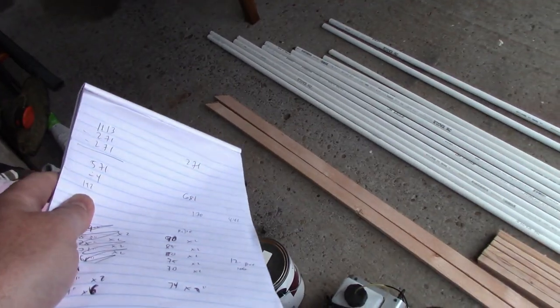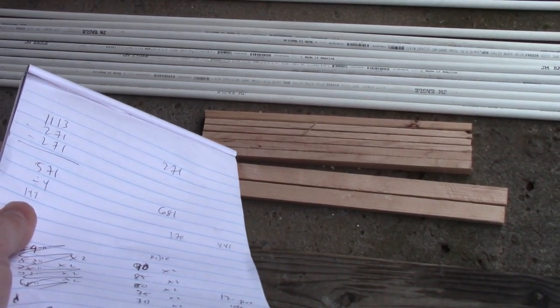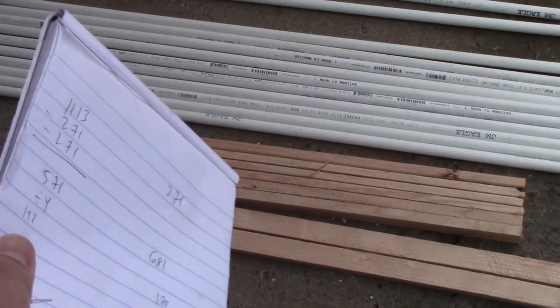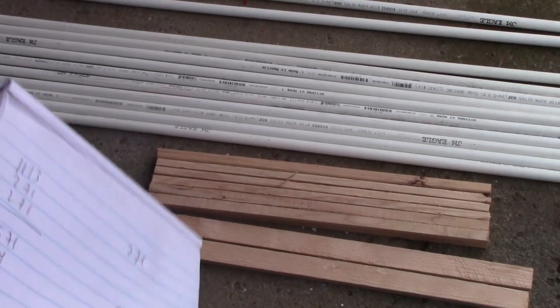So then you also cut, those are 72 inches and I cut them at a 45 degree angle on the top there. And then you have six of these that are 24 inches, and those make the upright there, the bottom there, and the bottom there. Then on four of those, you're going to drill holes for the pipe to go through. The one right there is a 2.5 inch gap.